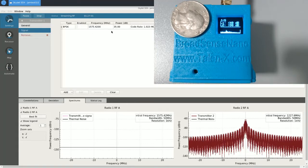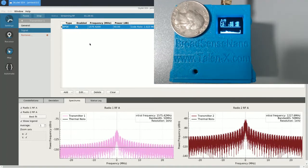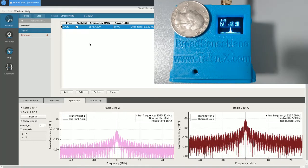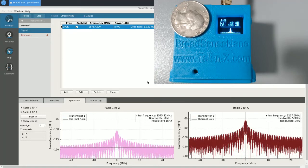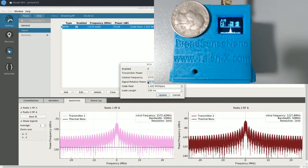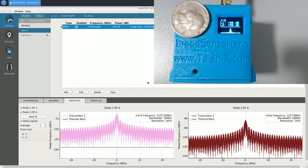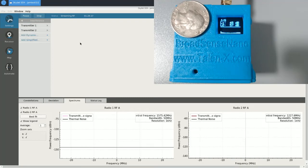While leaving the L2 jammer on, I'm going to go back to L1 and try a couple of values. Let's try 50 dB — you can see that even when we're experiencing 90 dB of J to S on L2, we can correctly indicate 50 dB of J to S on L1. Let's try 70, and 90 — now we're indicating that both L1 and L2 have exceeded our sensor's capabilities. I'm going to turn these jammers off and we'll see how long it takes to settle all the way from 90 to 0 J to S. You can see it's not immediate, but it is only a few seconds to get back down to less than 35 dB.